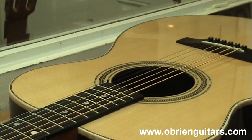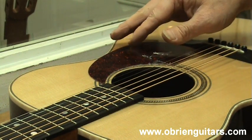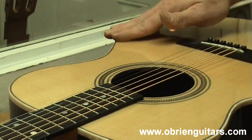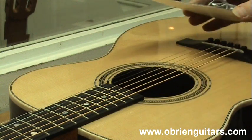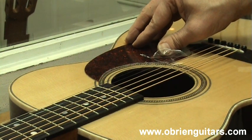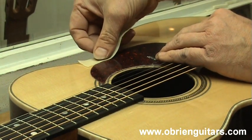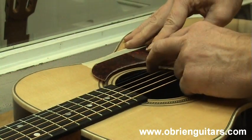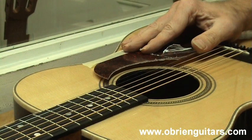Now to place the pickguard on your guitar, there is more to it than just peel and stick. You want to be very careful with placement and make sure you don't get any air bubbles or debris under there. Make sure that the guitar is clean. Position the pickguard where you want it. Next, come in and place a piece of tape along one edge — that is going to work as a hinge. You can now lift the pickguard and when you flop it back down, it is going to go right back in place in the correct position.